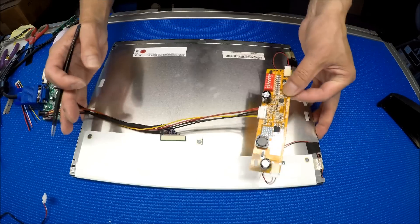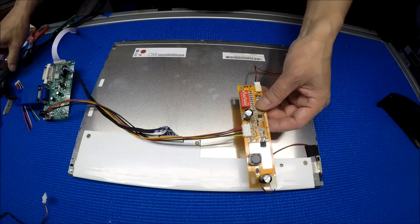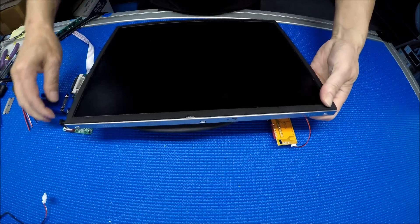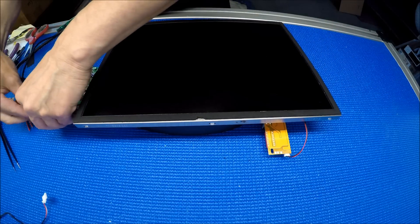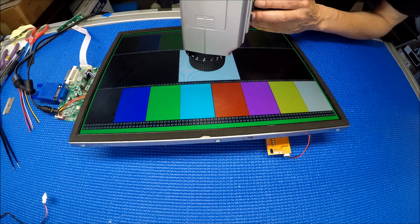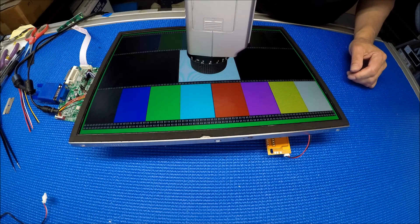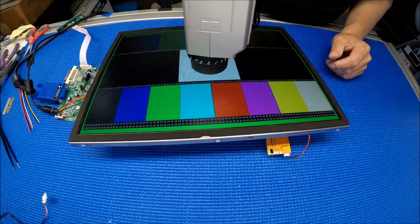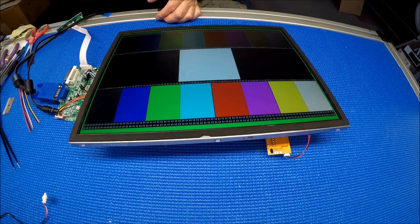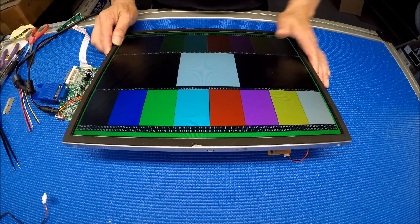If a customer complains the screen is too bright, you can change the DIP switch setting to the lower one — two and five on. The lower setting means generally less nits and the LED lasts much longer. The higher setting is much brighter but draws more power, meaning a slightly shorter lifespan. The low setting still gets about 425 nits — still much better than CCFL. I would suggest sticking with the default setting which is switch one, getting about 920 to 950 nits — that's good enough. Thank you for watching.